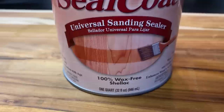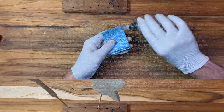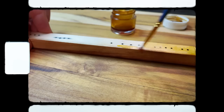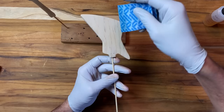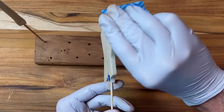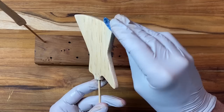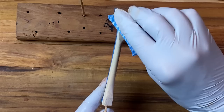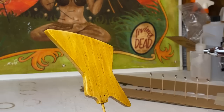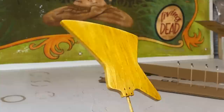Shellac. Shellac always seemed like a thing that was very difficult to apply because I didn't know what I was doing. But I looked up a bunch of tutorials and learned something. Earlier when I was testing the shellac on my experimental stick, I was brushing it repeatedly to smooth it out — this is totally wrong. What I learned is that you need to get a clean cloth and just do one wipe per coat. Keep that cloth moving, don't stop. And did you know what shellac is made out of? Bug poop. I was able to smooth out some ripples by airbrushing some 91% proof alcohol on top, which melts the shellac layers a little bit. It's not perfect, but it did help a lot.